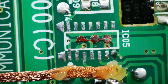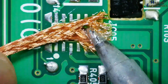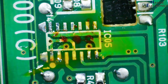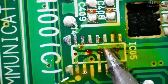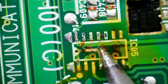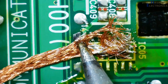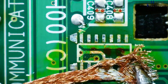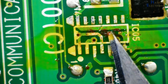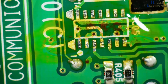Take the soldering braid and place it here. First I will remove the epoxy from the pads. Now clean the pads. Never overheat it. Using isopropyl alcohol, I will clean it.